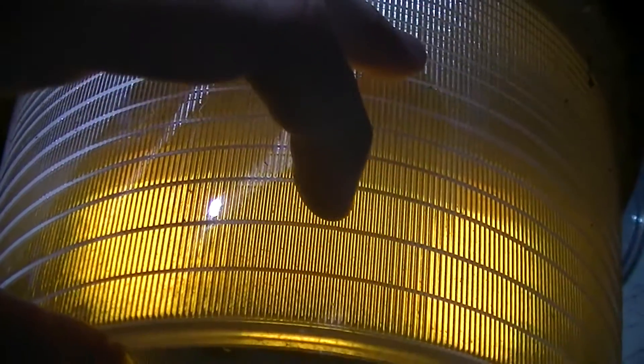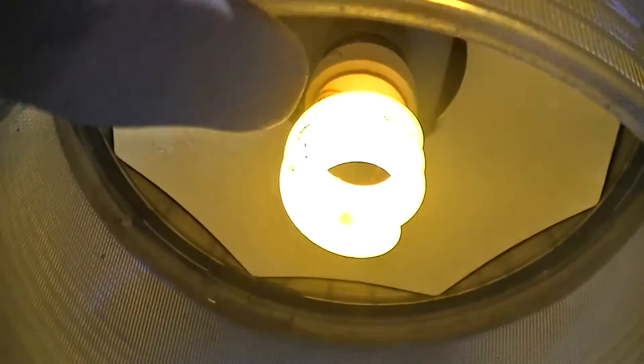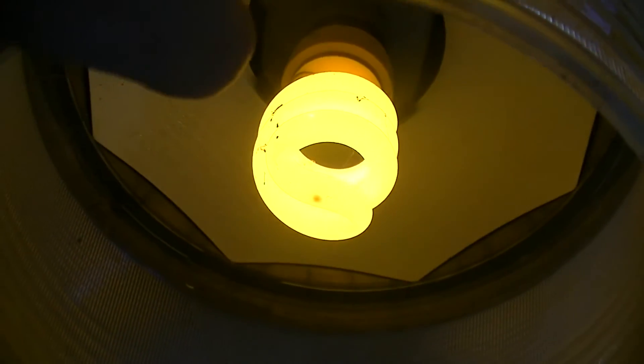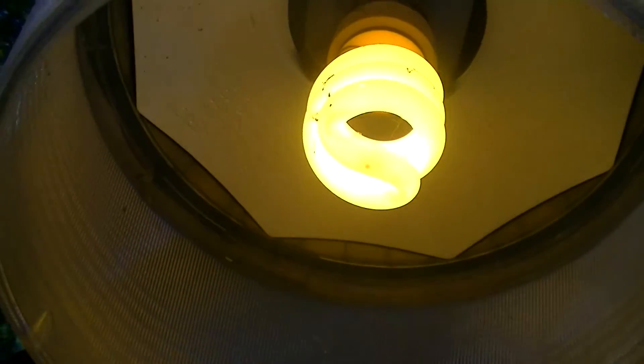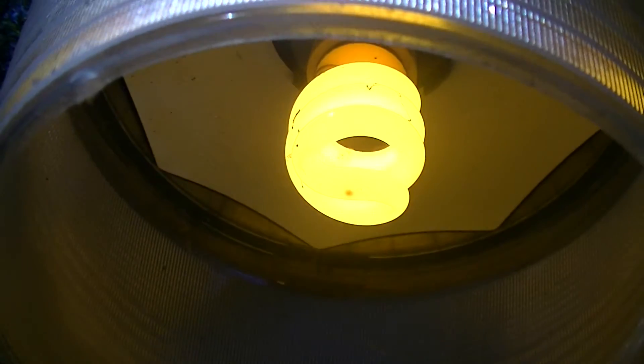This image of the lamp seems to flicker a lot, but these two older images of the lamp look more normal, though they flicker a bit on camera. But that could be just some kind of beat frequency artifact between the camera frame rate and some flickering artifacts of the discharge, because viewed directly the discharge appears more or less normal.